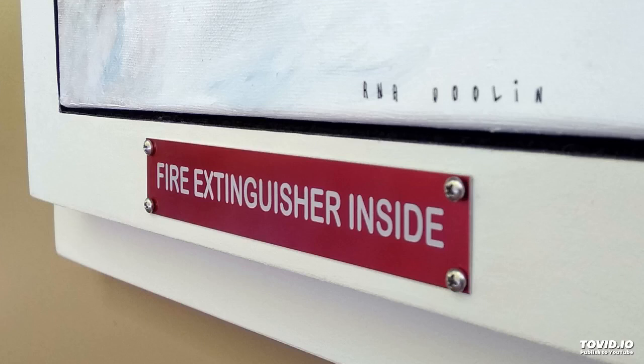I'll make a few comments too. It would have been easier to use a step stool instead of reaching so high to use the saw. Just be careful if you use a step stool. You don't want to fall off. Also, don't forget to put some paper on your floor because the drywall dust will fall down. And if you don't leave your shop fan on like I did to cool off, the powder will fall straight down, and it is easier to clean up like that. It doesn't hurt anything, just makes me look like I have a bad case of dandruff in this case.